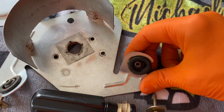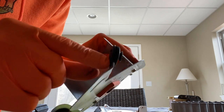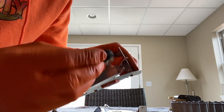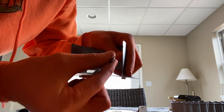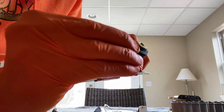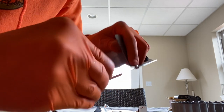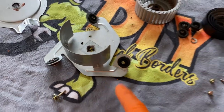We're also going to replace all the rubber grommet gaskets. Carefully pull these out and take note of how they are designed: on the front side it's basically flush, and on the back side you have a washer. These just pop out. Grab your new ones and clean the area a little bit with a towel or rag. The bottom washer portion goes on the bottom — you've got that little groove. Carefully shift it into place and do this for all three grommet gaskets. All three are now installed.